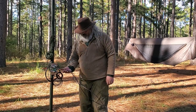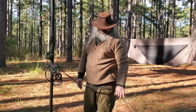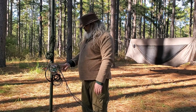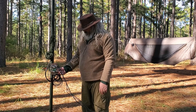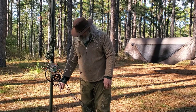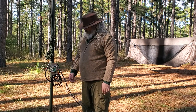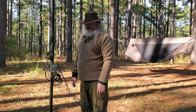Standard coax runs back to my tent where I have my radio, battery, and gear set up, allowing me to operate out of the rain. If lightning strikes and comes down the cables, it will hit the grounding blocks, blow the fuse elements inside, and the only path to ground will be through the cable to the spike in the pole. This should prevent lightning from reaching my equipment or harming me — I prefer to operate safely.